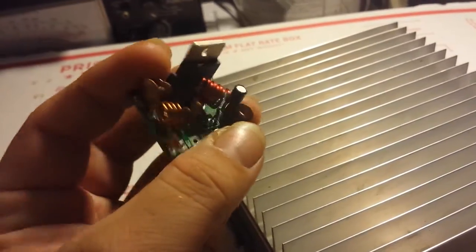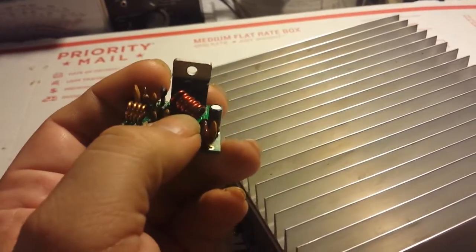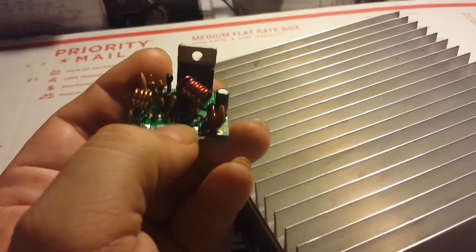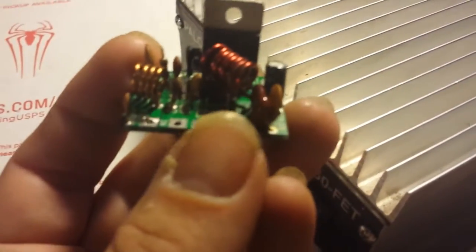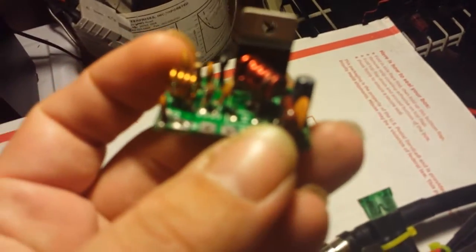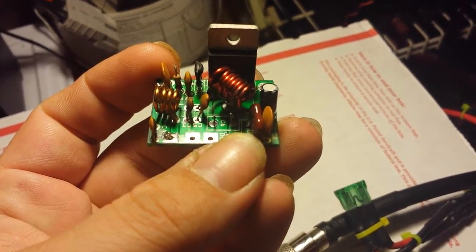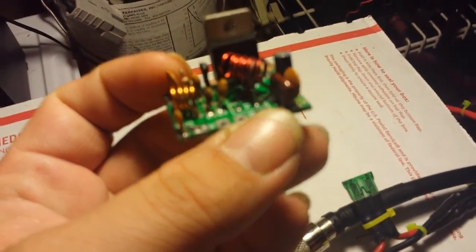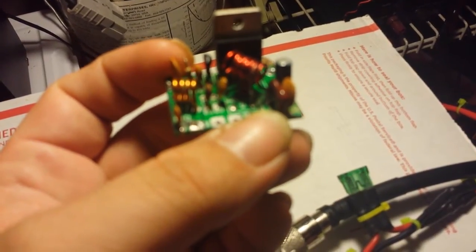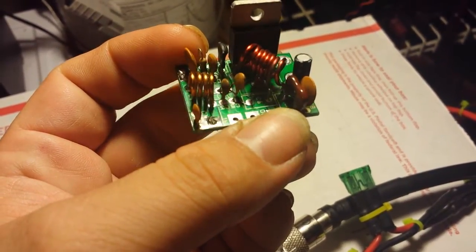This diode back here — the back of it is blown out and melted. This coil is even... I don't know how that happened. It might have been from a cap. There's a cap right here that looks like it completely blew off. That's the whole gist of this whole thing. Let's see if I can focus in on that cap. You see that C6? You see C6? Here is my issue — C6. You see there's two leads popping up. That cap had blown so bad it looks like it literally just shattered off.